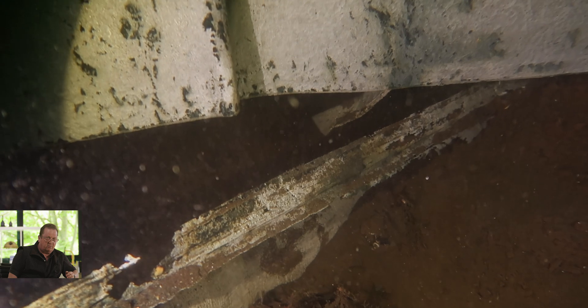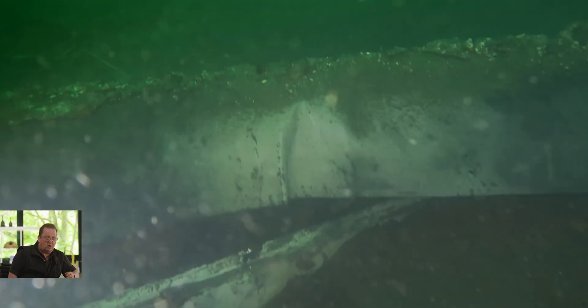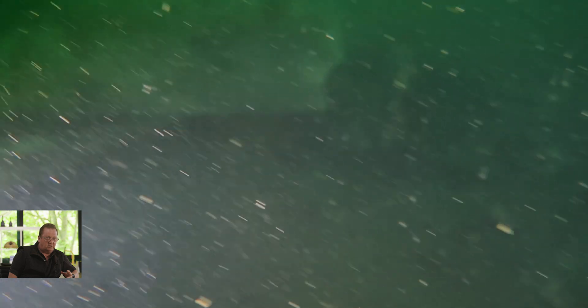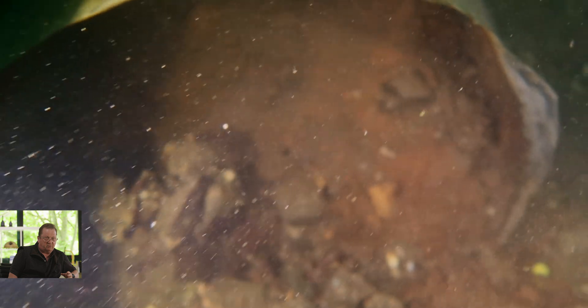You can see the mine charge case is almost empty — there are a few scattered remains from the bursting process. The process has quenched. You can see the mine case has been very badly disrupted; the end plate has been pushed off with a little bit of explosive residue, but not very much. This is all loose now and broken up. If you had detonated it, you'd have about a six-meter crater, nothing left, and a lot of damage and noise.